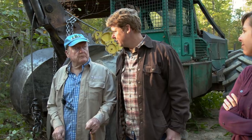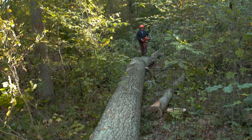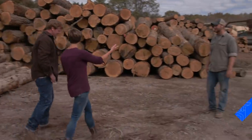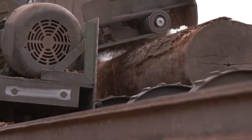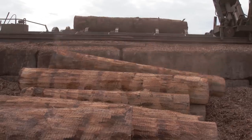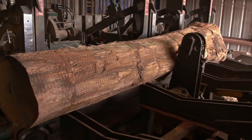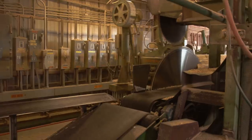What do you think of that piece of lumber? I think it's beautiful. About 700 square feet of flooring could be made out of that log. Really? Can you guess how old that is? It's probably 80 years old. So that came up from the original clear-cut. That's a large enough log to quarter saw. Along with this harvest, Jessica and I made our way to the sawmill run by her brother Jake. The log goes straight to the debarker — to prep the log and protect the downstream mill blades, the debarker makes short work of the coarse exterior, which is sold off to landscapers as mulch. From here, the logs progress inside to the mill and are turned into cants by the head saw. A cant is a log that's been squared on all four sides, which makes it easier for the resaws to cut it.